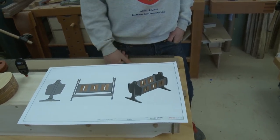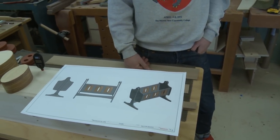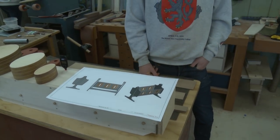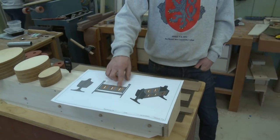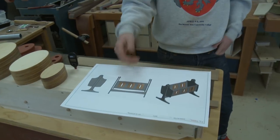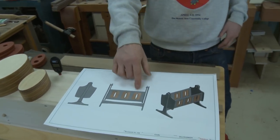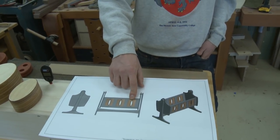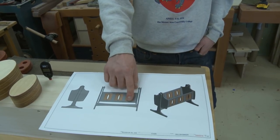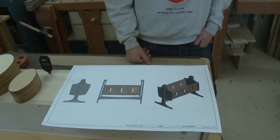With mortise and tenon, they are actually just straight — they're not following that curvilinear path on the outsides of the cradle form. Just to expedite it and give it a different look. It is a little bit of a departure from all the organic lines going on the outside, but I think it's a good marriage. On the actual panels here I've got these little cutouts — they end up being two boards, but the way they look right now is they're kind of an elliptical cutout with a V-groove running down the center, and then an eighth-inch chamfer to tie it all together as an edge treatment.